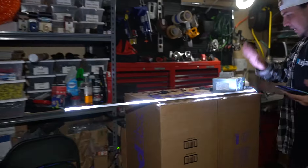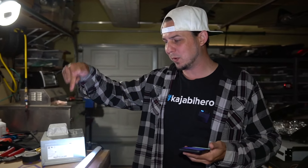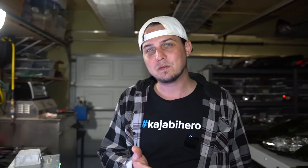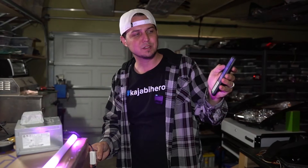So this is going to be an experiment: how do I power up some cool addressable LEDs and stick it behind my monitor and make it look dope? I'm actually going to get power from USB. I almost took this old computer power supply and this five volt converter, even though this thing puts out five volts — I didn't even think about it. Even more dumb than that, I have USB outlets that I installed in that room and they put out five volts. So we're going to test a USB control plug thing and see which wires we need to tap into to get five volts, then plug it into this addressable LED controller — the SP110E. Then we'll get to plug it in and control it with Bluetooth behind my computer. Should be dope. Let's go find out if it's going to work.